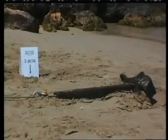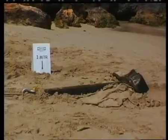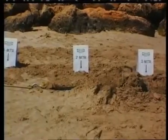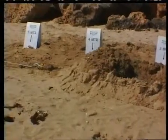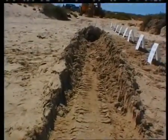The 180 kilogram Hall's anchor begins dragging when the load is applied, and after 1 metre of travel, the load has only reached 260 kilos. The holding power continues to increase to 500 kilos after 2 metres and reaches its maximum of 550 kilos after 4 metres. There is severe soil disturbance with no real penetration.